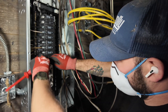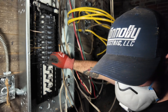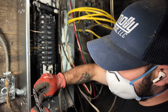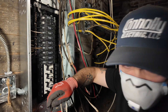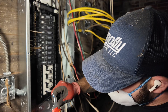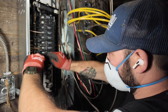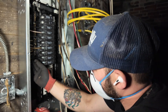We made note of the more severe insulation cases that we're going to upgrade first and prioritize safety above all. As things get modified, the arc fault and GFI breakers will come into play and we'll upgrade all those for the various circuits, because there's other stuff in the house we're going to obviously upgrade along with the circuits. We're trying to keep everything up to 2023 NEC code as we go forward, but for now we just needed to get this part of the project done.